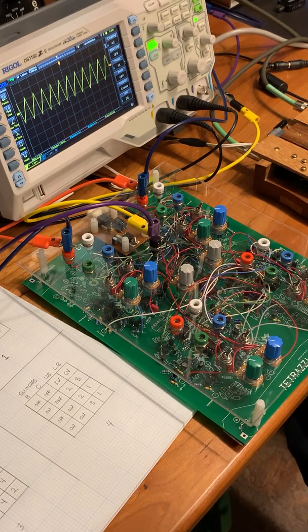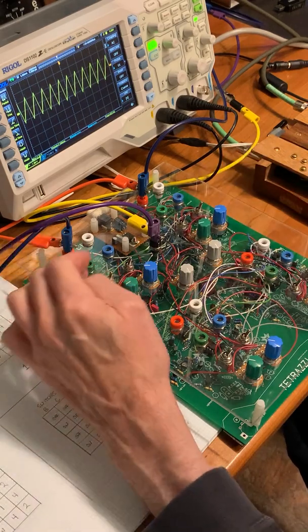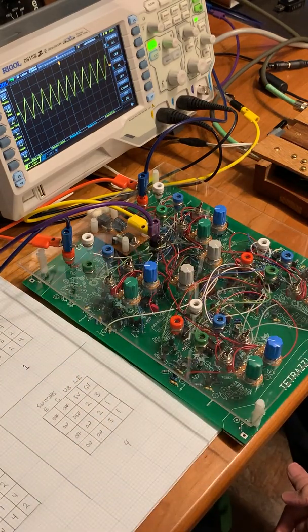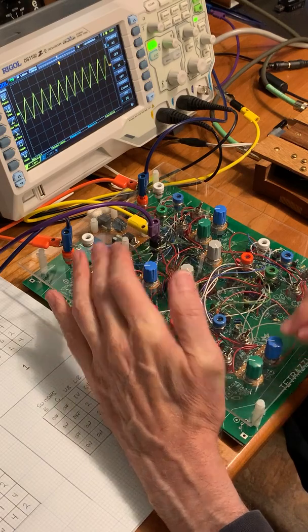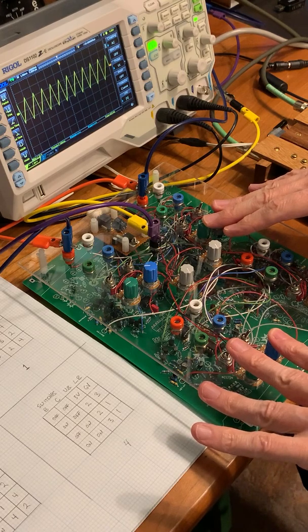What's interesting is that in this design, also in this, but it's not realized quite as well, the upper and lower bounds can be modulated. In fact, they are modulated by two of the other oscillators in the cluster. And there are two switches on each of these. Each of the two switches represents a binary 2-bit code that determines which pair of the other three are to be used for bounds modulation.